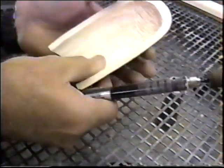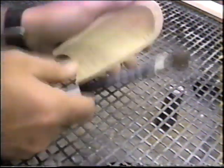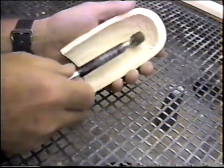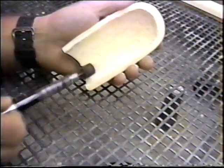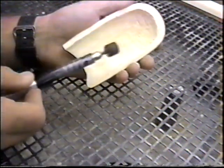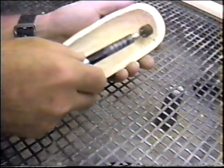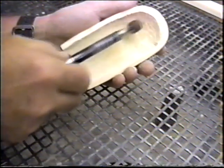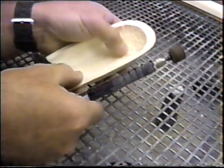Using your finger, oh, I see it's a little heavy up here. But using that back and forth technique, it really allows you to take a lot of material out in kind of a big hurry. Where if you did all the turning this way, you'd almost always find a spot that was too thin and then whoop, you got a problem. Especially if you were going to actually use this piece for a cowling, you'd like it to be relatively equal, not thicker here, thinner, thicker, thinner. You'd like it to be all the same.